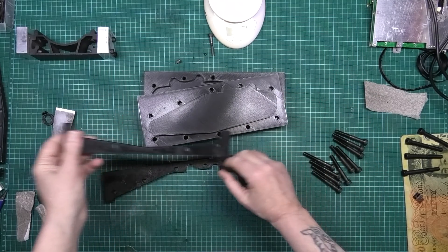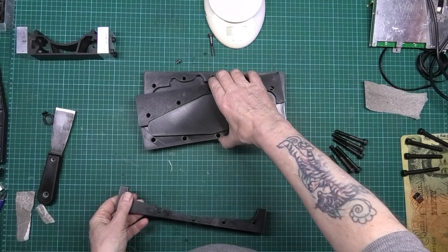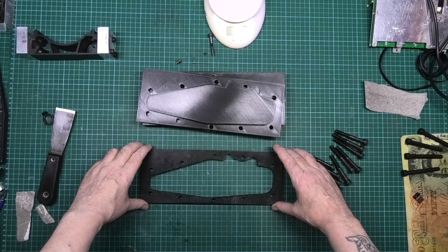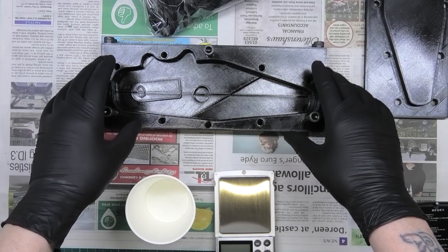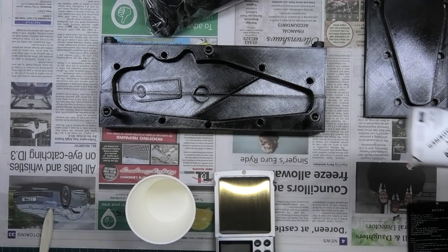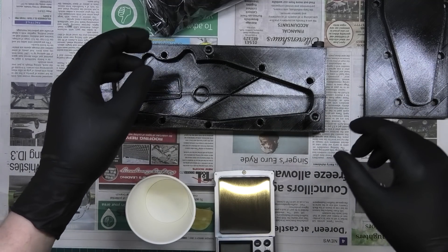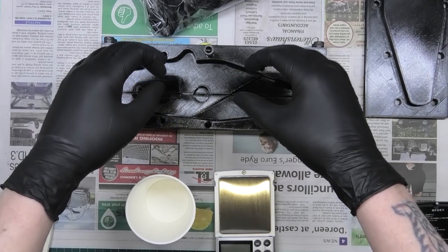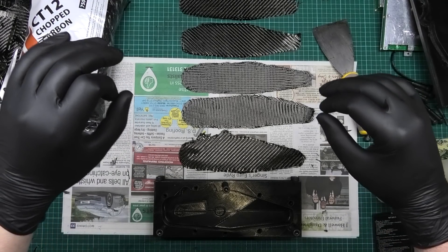What I'm going to do is grind down the side rails rather than the piston itself, then bolt them together and get my drill out. This is the biggest forged carbon fiber piece I've done. I'm using infusion resin with slow hardener because I need a lot of time to work it in and make sure everything is perfect. I'm using chopped tow as you normally would with forged carbon, but I'm also going to include a layer of normal woven carbon fiber.